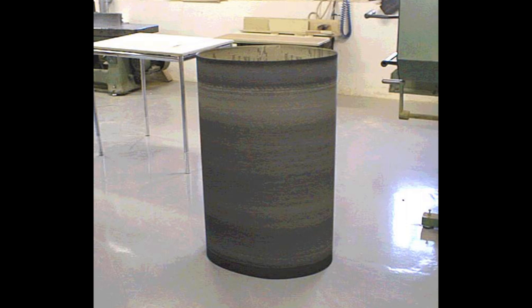I'm going to show you some pictures I recently took at a customer's place. What you have here is a paper wide belt and as you can see they have it sitting on the floor. That's not a good way at all to store a wide belt, especially a paper one, because this paper basically acts like a sponge. This end of the wide belt is just sucking up water like a sponge would — it's going to absorb more water than the other end. So when you put that belt on the machine, this side has swollen and it makes it difficult for the belt to track.